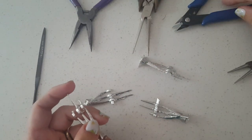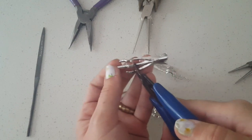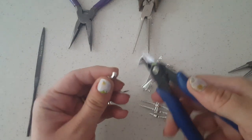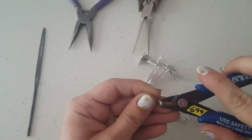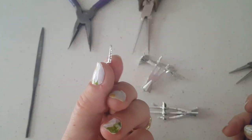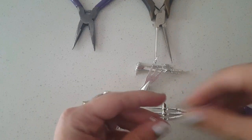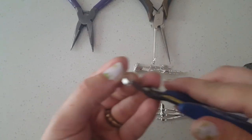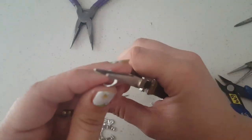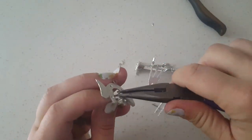To use these pins I need to separate them. Only one of the three turned out this time, so I'm separating that one and cleaning off the extra metal flashing with blue clippers. This pin wasn't made for this specific project, so it's a little too wide and too long. I'm going to shorten the pin and file down the rough edges. The base is way too wide to fit into the brooch, so I clip away the excess — pewter is a really soft metal, so this is easy — then file the rough edges smooth. Then I bend the end of the pin into a little circle so it'll fit around the edge of the brooch.